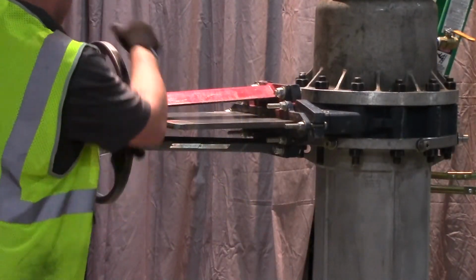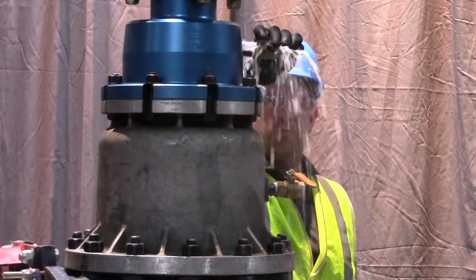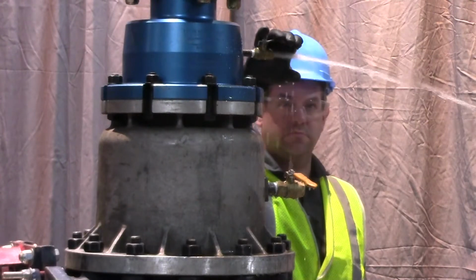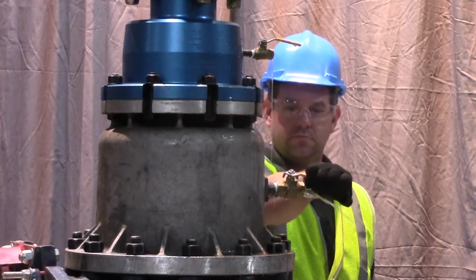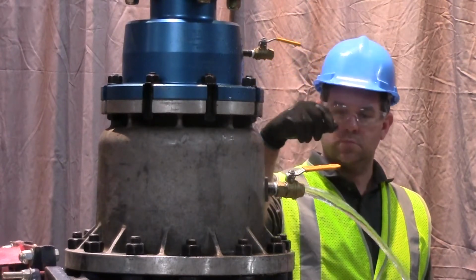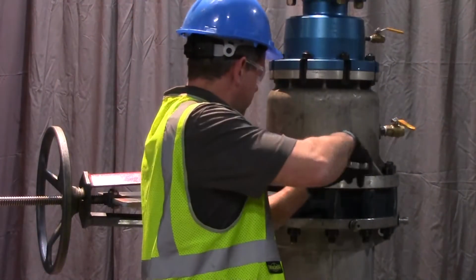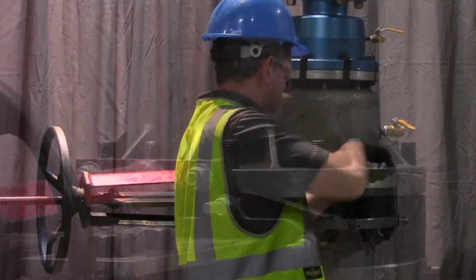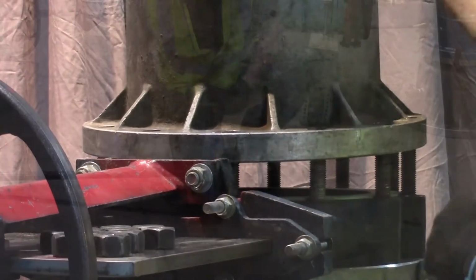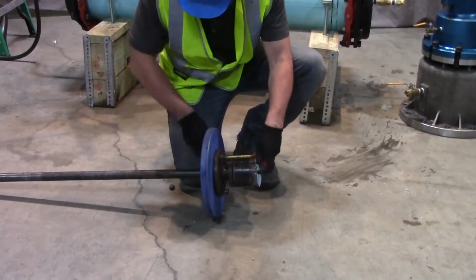Close the temporary gate valve. Relieve the pressure from the tapping assembly by opening the ball valve on the Hydra-Tapper and the P20. Loosen the nuts and carefully remove the Hydra-Tapper assembly. Disassemble the core tapping equipment.